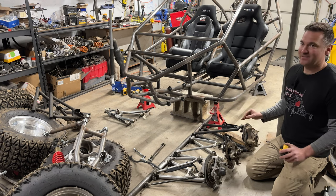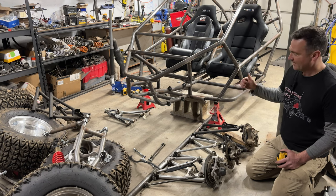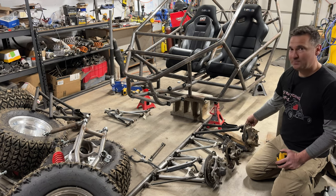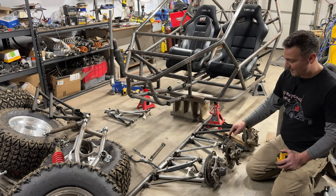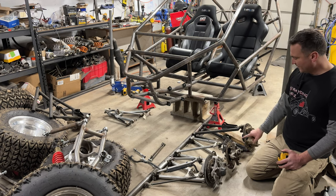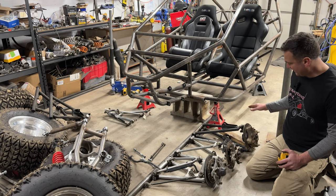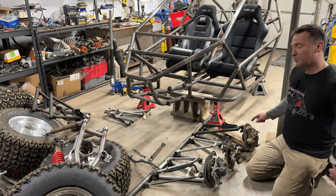So, I mean, that's just my logic approach to all this, that these aren't too heavy for ATV arms because they use the same components as the big boy stuff. Now, these are cast, but you have a drive shaft running through them, so they're under more stress than just a stub axle hub. The brake disc is bigger, the hub is heavier. It's the same bolt pattern, 4x156 on all three, and it has a two piston caliper brake on it too.